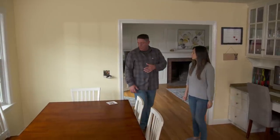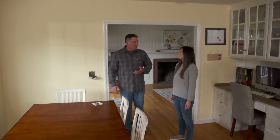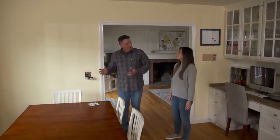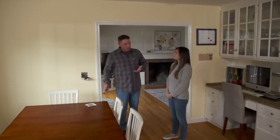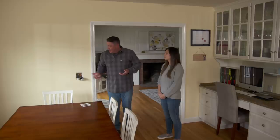I've turned the power off and taken the switches out to see how they're wired. They are single pole switches, meaning one switch controls either a single light or a group of lights. Ideally we'd want a three-way — a switch on each end of the room — but that would require running wire through the finished basement, which means some damage, time, and labor.